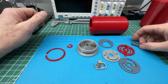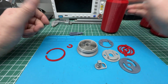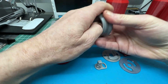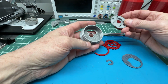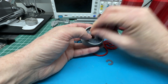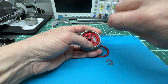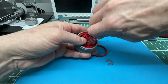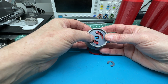These are all the parts that make up the product. The can itself is pretty straightforward — it should print without any difficulty. No support is required on any of the parts except one piece, which has built-in support, so don't add support in your slicer — just break it out. With the printed support removed, put in the push-down plate — everything's indexed on a little nub. Put in the spacer, then the locking tabs go in one side, then flex the other side to drop it into place.